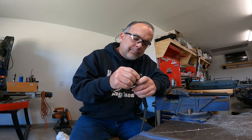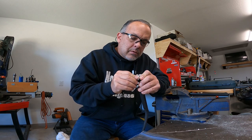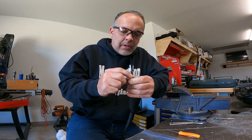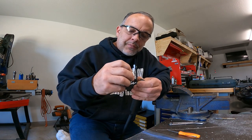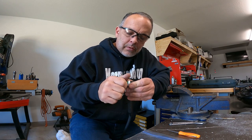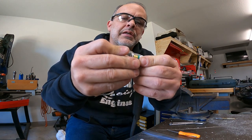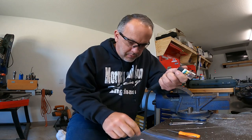Let's see what it does. My torch is not cooperating and the rubber piece is not in the best shape. I ended up having to chase the threads in the head of the torch — for anyone wondering, they are 8mm, 1.0 pitch. The O-ring goes on that piece, the insulator goes on there, and you screw it all together until it bottoms — and you stop. Don't crank down on it because it's not going to work. The cup just slides on and that's all that holds it.